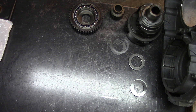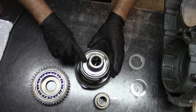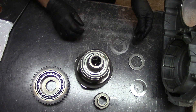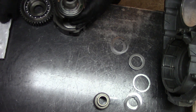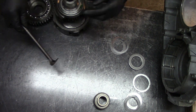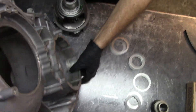I have the rest of the pieces right here — I have the differential, I've already installed a shim here, and the two that I was going to use over here on this side. I use this little tool because this bearing gets kind of stuck on the case. Let's go ahead and get our other side of the case.